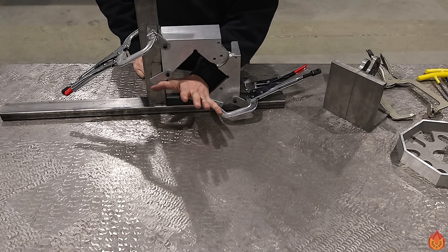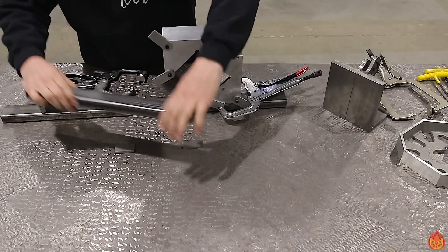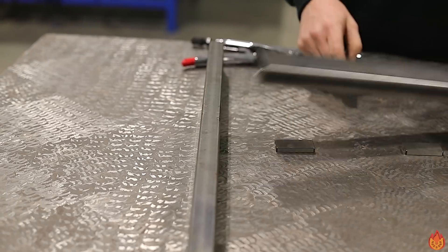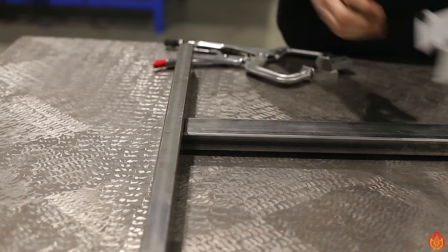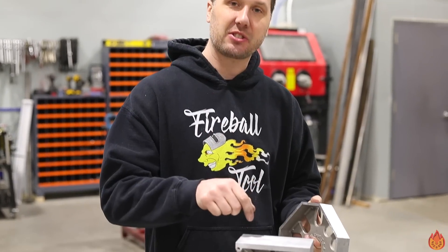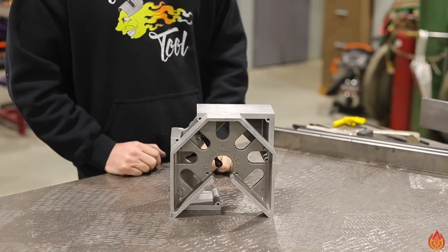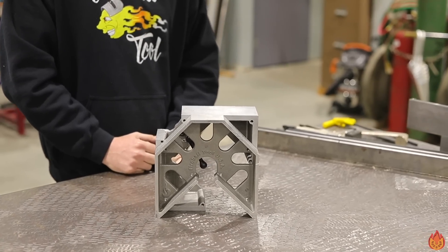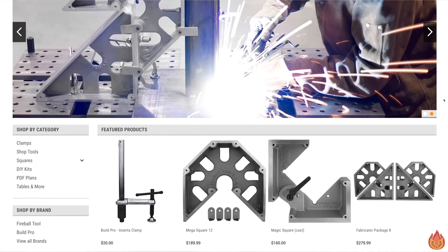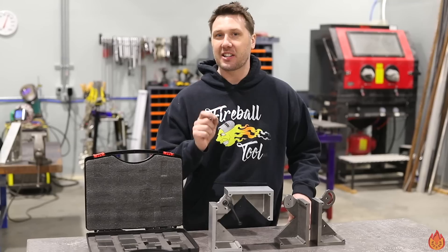And this is the beauty of this square — do you see all this room over here? I can literally weld all the way around this thing. Put your shims down on the table, your tube steel however you like, and now I know I'm a quarter inch spaced off the table. Pretty universal. If you already own the current mini squares, this is an awesome accessory to equip yourself with for whatever comes down the line — it does the same height and width, so it'll fit right in with what you already have. Thank you guys for joining me on this quick little demo. Be sure to check out fireballtool.com for both of these products — the Magic Square and the Shop Shims. There'll be a link in the description below. I'll catch you guys on the next one.